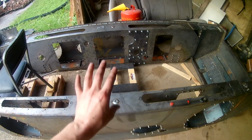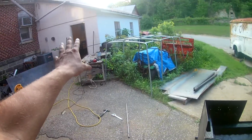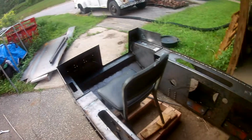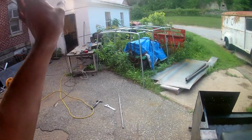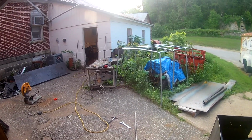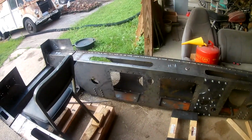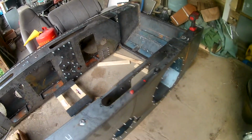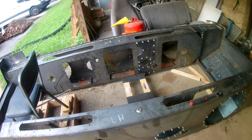The other reason was it allowed me to do a lot of these sub-weldments in the climate controlled shop over there. So of course, if you've got a small shop like me, you can burn these off in a nice secluded lean-to type of deal like that. And then bring everything out, say, during more temperate climates, like in the spring and summer if you're in the Midwest, and bolt it and do the final weld.